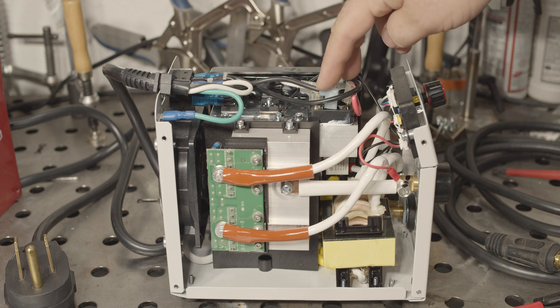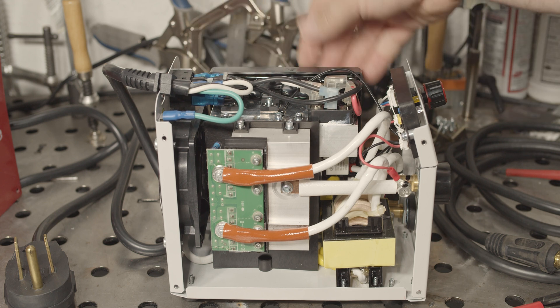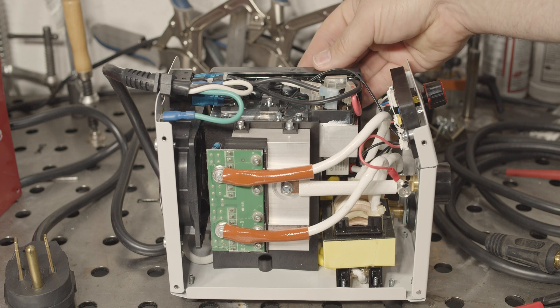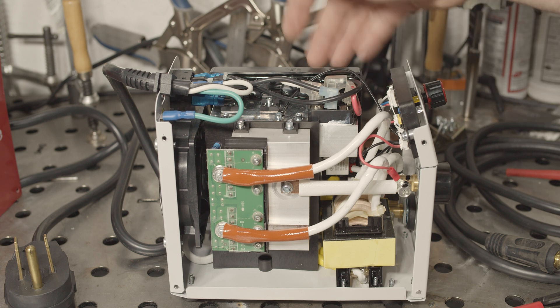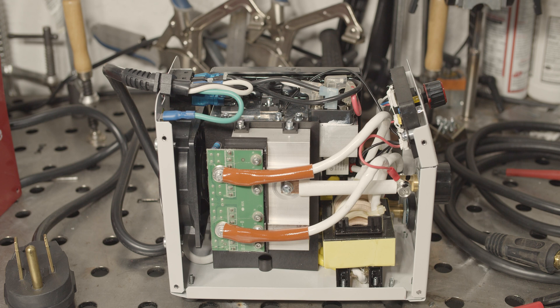The single fan does push a surprising amount of air. The heat sinks are designed to create a bit of a wind tunnel, and the capacitors are right down in that airflow, so that's nice to see. The input power comes straight to the rectifier and then into the potted inverter board, so clearly there's no power factor correction or input filtering — it's converted straight to DC before it goes into the board. But otherwise it's honestly a pretty clean, simple design, and if it does what it says and is reliable, it's a pretty slick little machine.